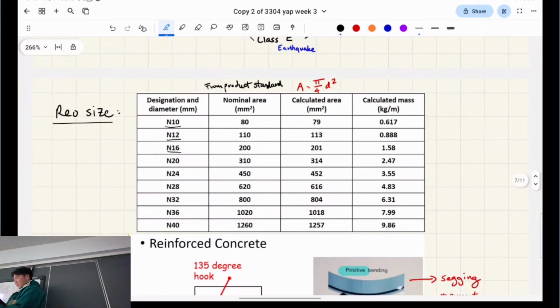Okay, so let's clear up another question. There's the nominal area and the calculated area. Do you see how sometimes the nominal area will overshoot and sometimes it will undershoot the values? Guess which one we designed for? We always design for the nominal area, and that's because even though it's less geometrically accurate, it's what's specified by the manufacturer. And if something goes wrong due to the nominal area, the liability falls on them.